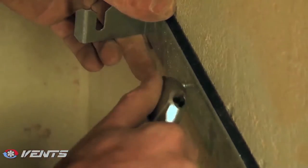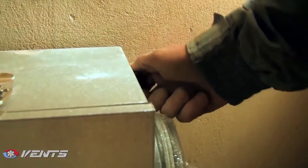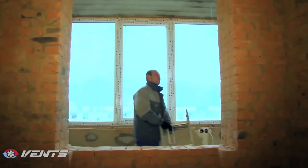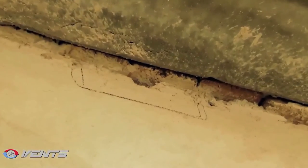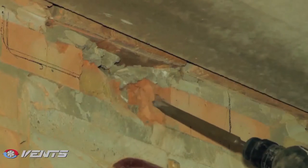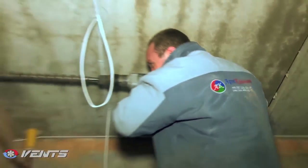The only element of the ventilation system requiring periodic inspection is the air handling unit, which necessitates proper access to all of its parts for convenient maintenance and repair. The air ducts are similarly mounted onto the inner wall of the balcony to be covered with gypsum boards with a 120 mm offset. The main air ducts reach into the studio kitchen, branching into the bedroom. The rooms have enough space to hide the air ducts behind the false ceiling with gypsum board elements.